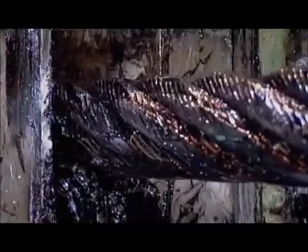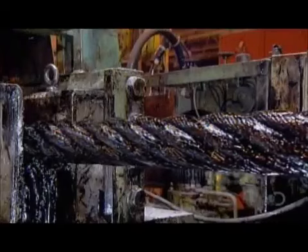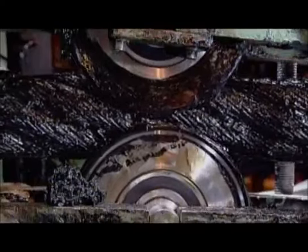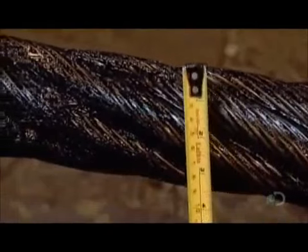This cable's finish diameter is 90 millimeters. However, there are always small variations here and there. So four calibration rollers — two compressing vertically, two horizontally — correct the cable to the right diameter all along its length.